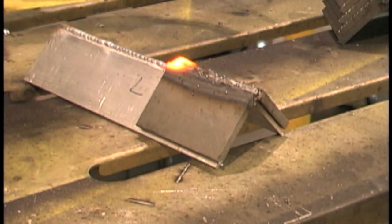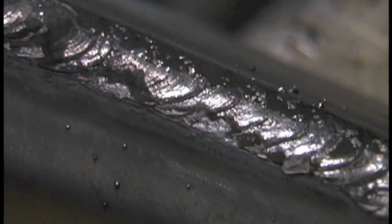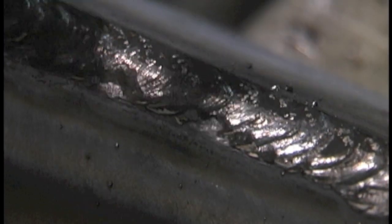When you do that it runs okay. As long as you keep your stick out adequate — it recommends a half inch or shorter — I've got it a little too short here, which can be just as bad as too long. But it's doing a halfway decent job: a little bit of spatter, and it looks like it's wetting down into the root of the joint.